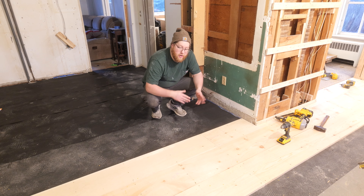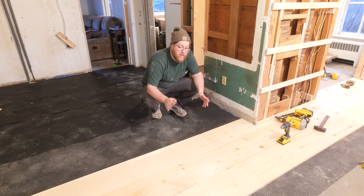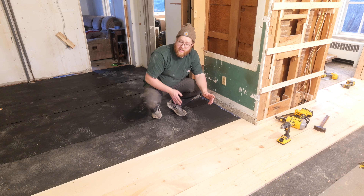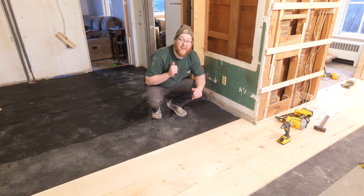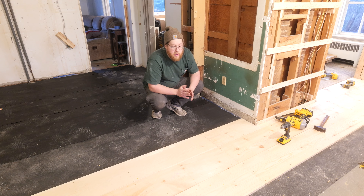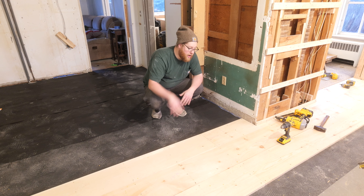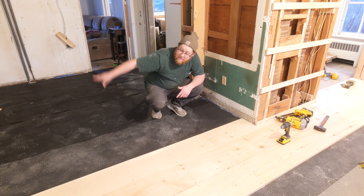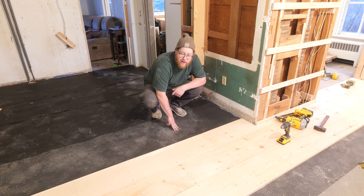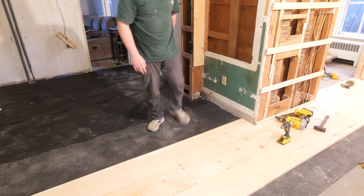In the hallway it's ten feet, so we're going to cut all the boards. I can cut them in batches as long as I check a couple places. Now that we have enough rows down I'm going to chalk line and transfer these lines all the way to the other side — my wife's going to give me a hand and then we'll pound this out. The kitchen won't be as easy because of all the floor leveler we'll have to drill through. Oh, I forgot how flooring kills your knees — I'm getting old.